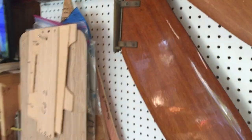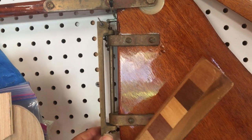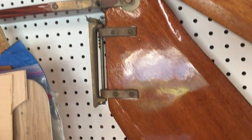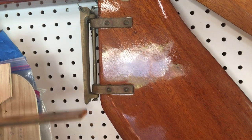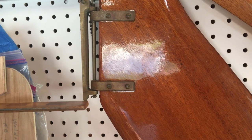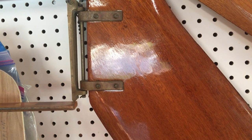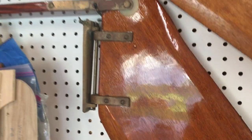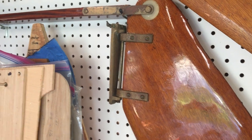But the fiberglass boats had a taller transom, so the vertical plate's about 7 inches on it, and that clips into the horizontal hinge plate, which runs across the top of the boat, where the hinge and the rudder pin goes. And then a latch plate on the bottom, when you hit an obstacle, a little detent in the latch plate, lets that, with the spring tension, let this bottom part pop out and swing away. So that's all part of their rudder releasing mechanism that got a patent in 1953.